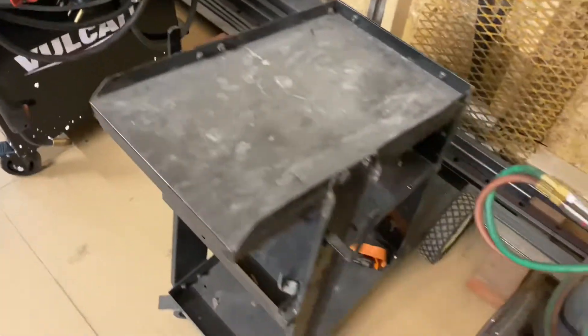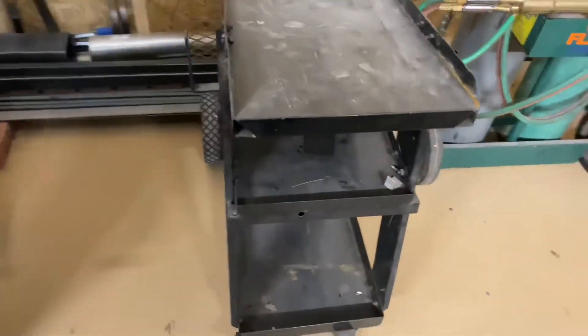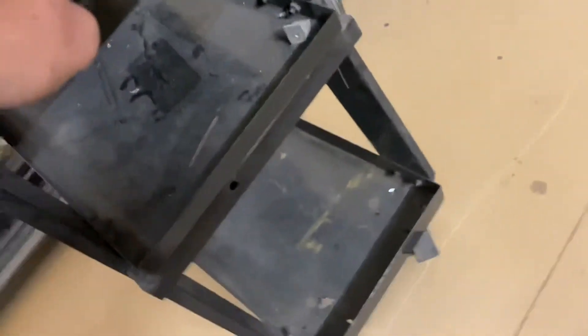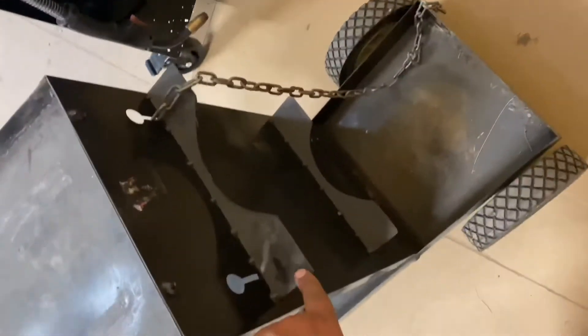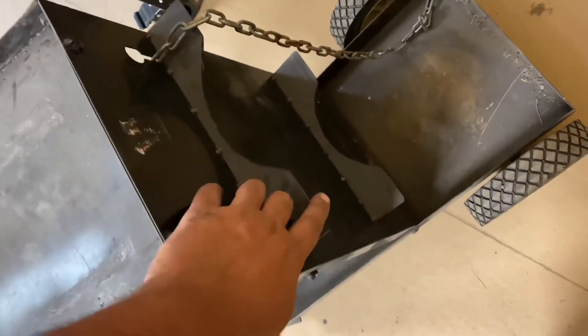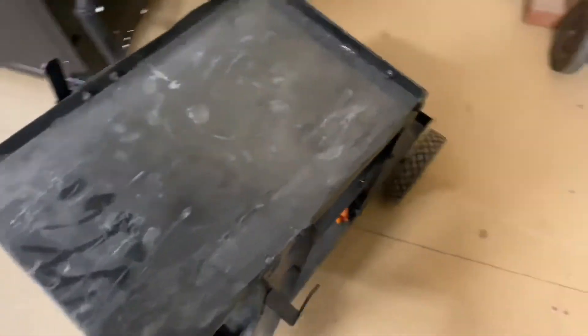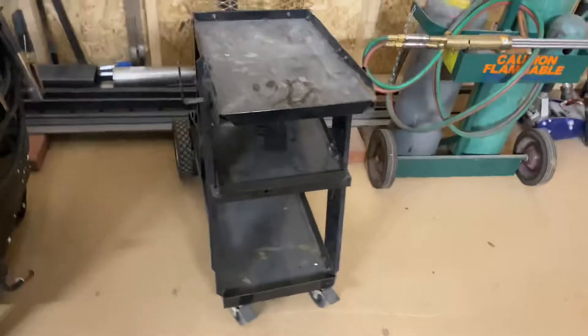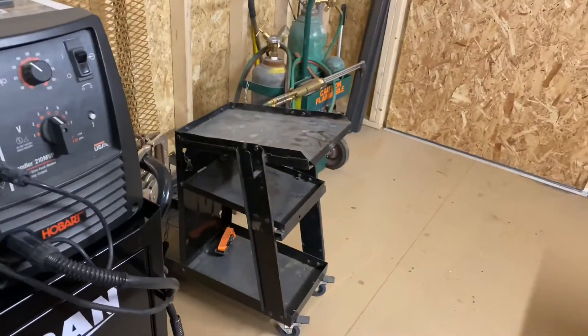I'm a little upset about that. I was hoping for a more durable finish, especially on a welding cart. But it is definitely a huge upgrade from this one, which is a base model Harbor Freight cart that's had extensive modifications - square tubing framed along the shelves on the bottom for extra strength, two pieces of angle iron cut and beveled into bottle supports on the back, along with bigger wheels on the back and better casters on the front. This is a good little cart for a small welder, but the Hobart 210 is just a little too big for it.